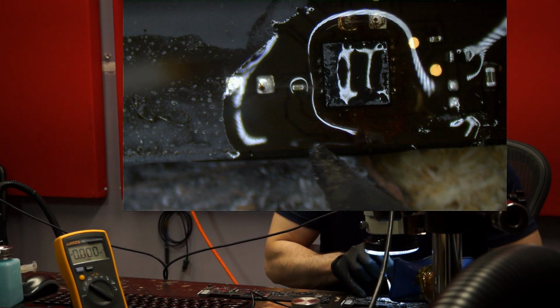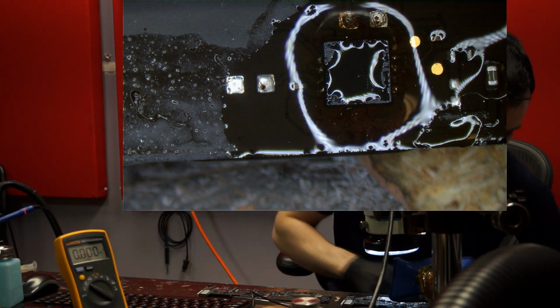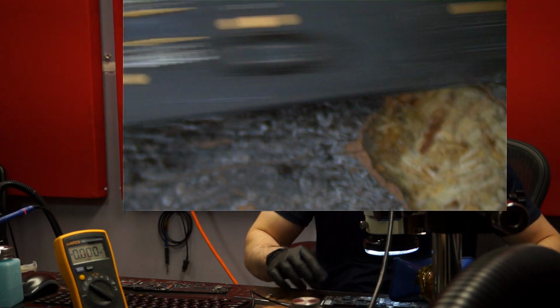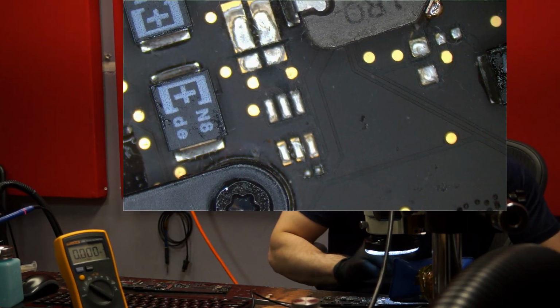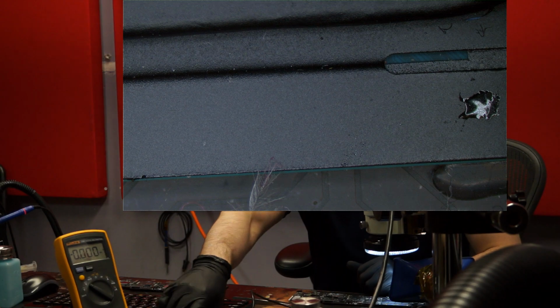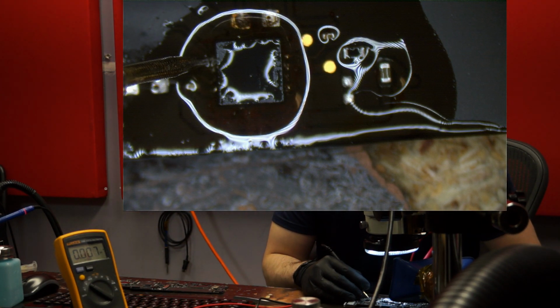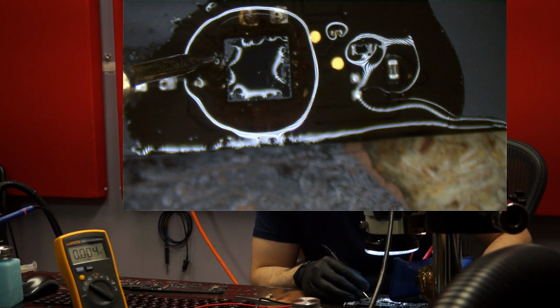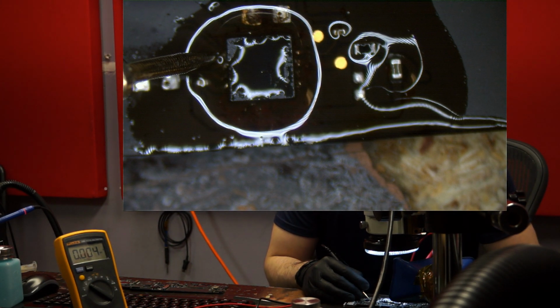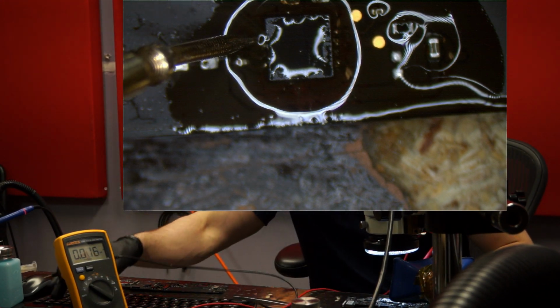That's not soldered on properly, but oh well. Light? No light. Okay then. Let's continue here. Is SMC reset L there? No, it's not. And we know from previous videos that means the SMC is probably pulling it down.